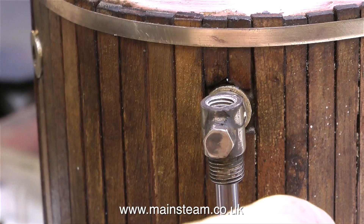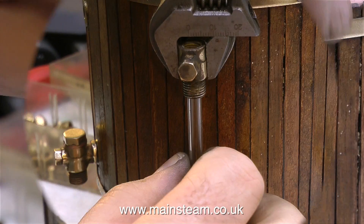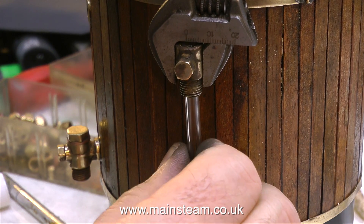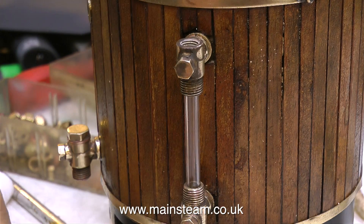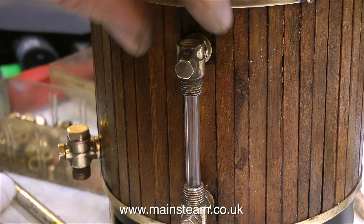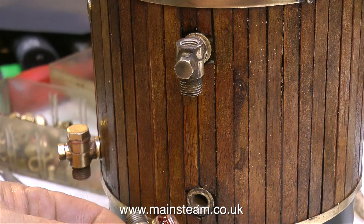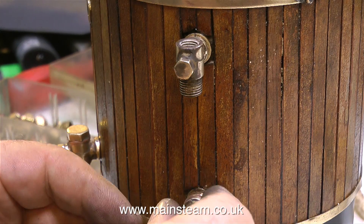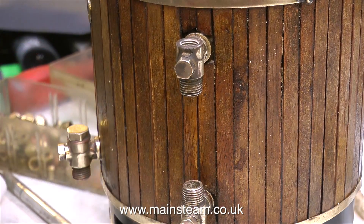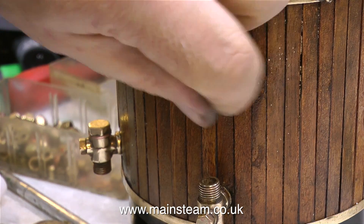I'm not just throwing the glass into the fitting — I'm catching it with my other hand. Then I move the glass left and right and forward and backwards until the movement of the glass is exactly the same all the way around. It goes without saying that the glass is not a tight fit in the brass fittings — there is some side play. I'm looking for equal side play and equal front-to-back play. By making fine adjustments to the position of the fittings — here I'm removing the bottom fitting and trying a different shim washer — I was so confident about this shim washer that I coated the thread in Loctite 542 and assembled the water gauge. With the bottom fitting in its finished place, I removed the top fitting and applied some Loctite 542 to that.